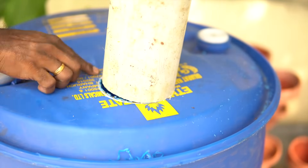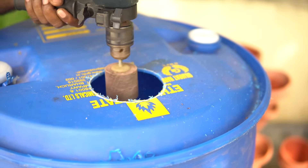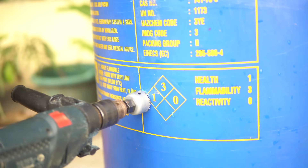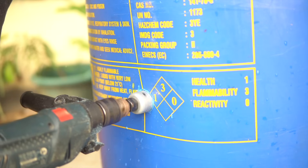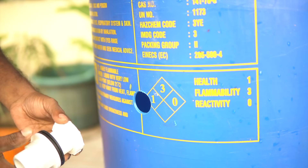The hole came out a few millimeters smaller than the tube, so I'll grind away the excess. I'll fit the PVC pipe only at the last step. Somewhere on the opposite side, approximately at about half the height of the drum, we make another hole — this one will be fitted with a tank nipple.